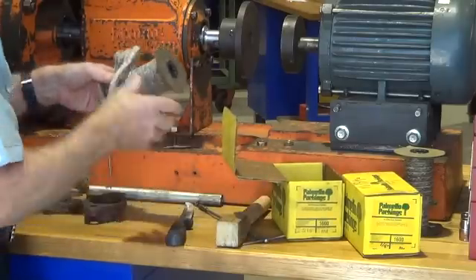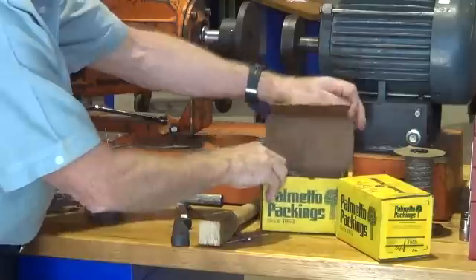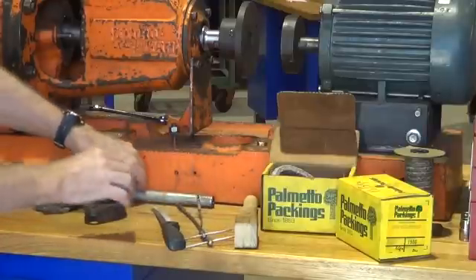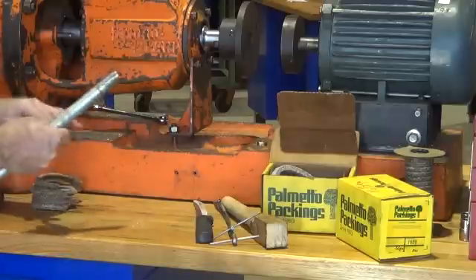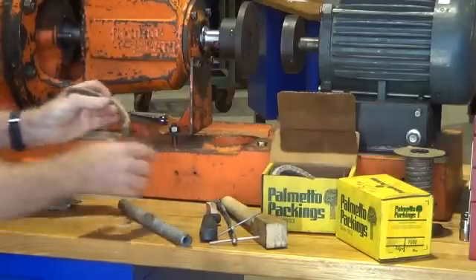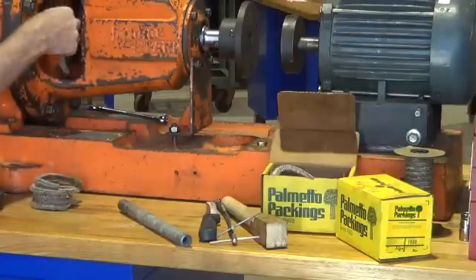A good sharp packing knife is required so you get a nice neat cut on the ends of the packing rounds. Packing extractor tools are flexi drives with a corkscrew end on them. A little bit of pipe, round dowel, or steel bar is suitable and handy for just rolling out the packing, because we roll it out and that thins the section slightly without damaging the packing, and it allows it to fit neatly into the gap between the shaft and the stuffing box.